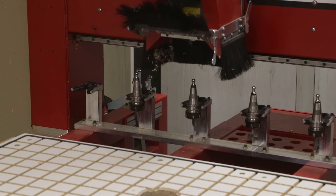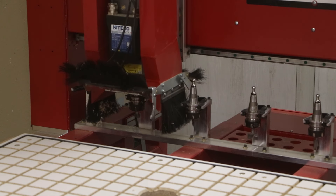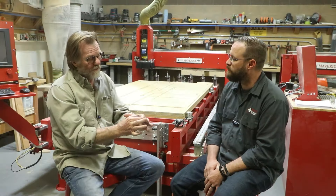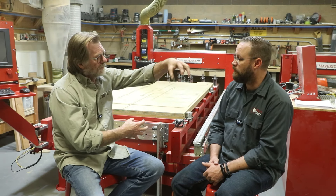There are a lot of systems where they just drop the tool into a hole. What's wrong with that is all your bits have to fit in the hole. If the hole on the nose of your tool holder is an inch and a quarter, you can't have any tools any bigger than that — it will crash into your table or jam up. But when we're doing turnings, which is our real claim to fame, I might be using a three-inch bit. That's why our system comes down, goes in, releases those fingers, comes up, and goes over and grabs the next tool — hovers above, goes down, and repeats the smart tool measurement.